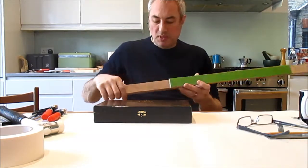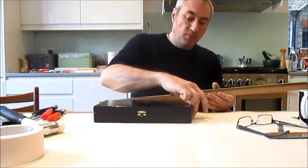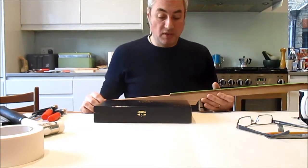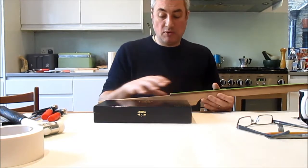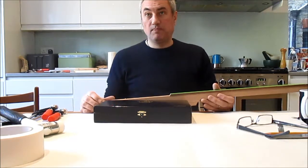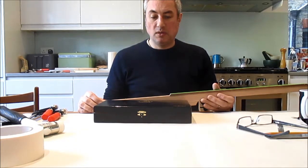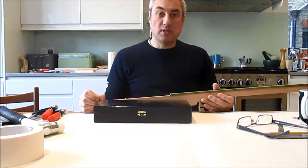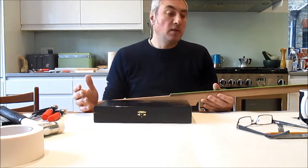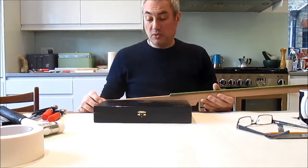so there was an element of cleaning up of the side, not by very much, but cleaning them up. And so the danger is if you cut the holes in the side so that it's a nice snug fit, and then you take material off the side because you're cleaning up this area, you can end up with a bit of looseness in there, which is what I don't want. But that's just my way of doing it. As with all these things, it's just how you want to do it. You can do it whichever order you want, but that's the reason I do it this way.